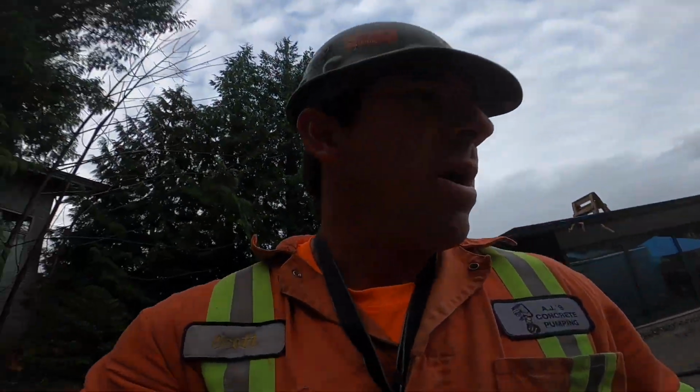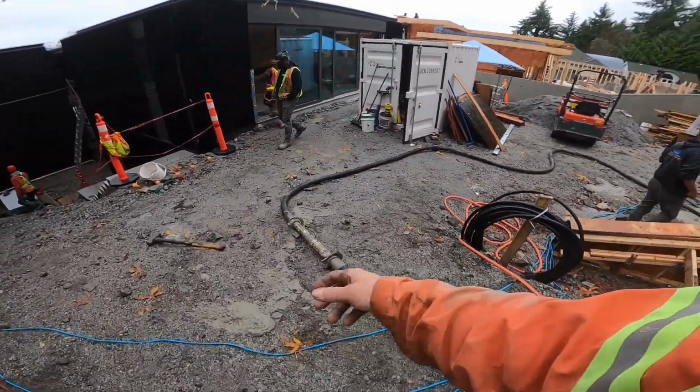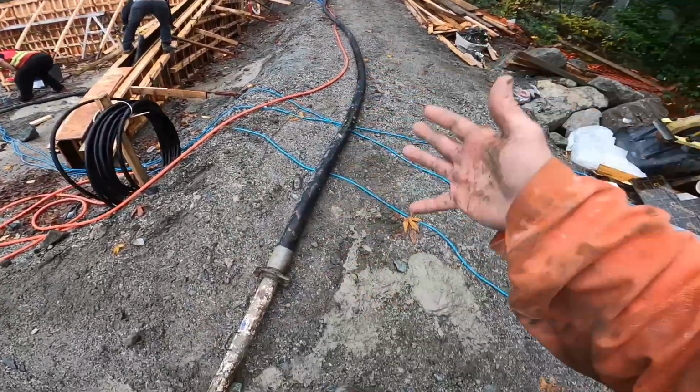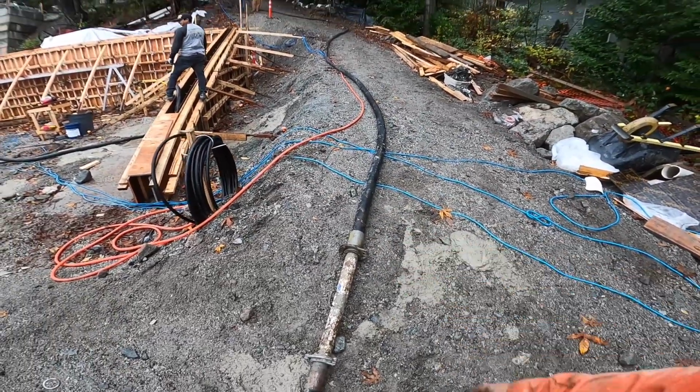Which is about exactly what we predicted. We got the bentonite through, a little bit of segregation at the taper. That was about a 70% chance of plugging. So like I said, we just snipped the hose off, shook a little bit of the rocky stuff through, and away we go. Even if we had primed this then connected up to that, we would have still had stuff on the ground, reconnect everything up. In my opinion, it was worth a try.